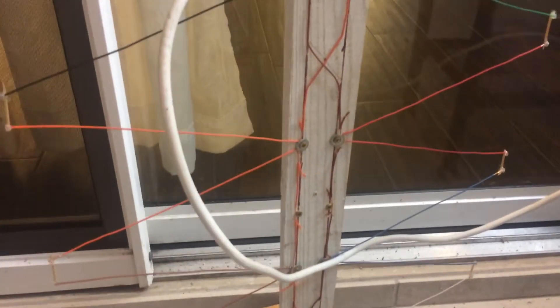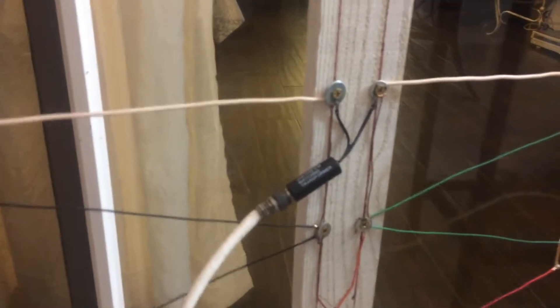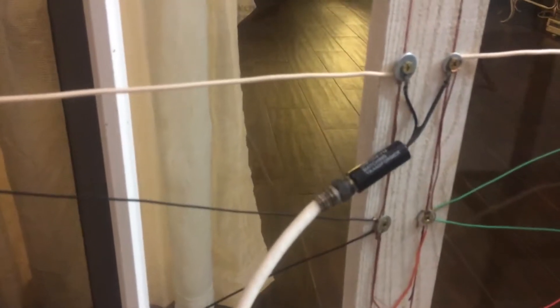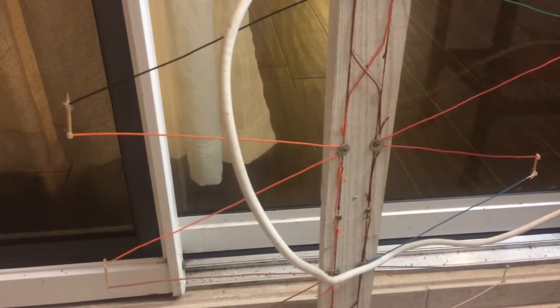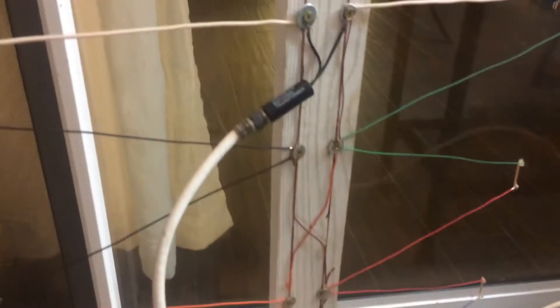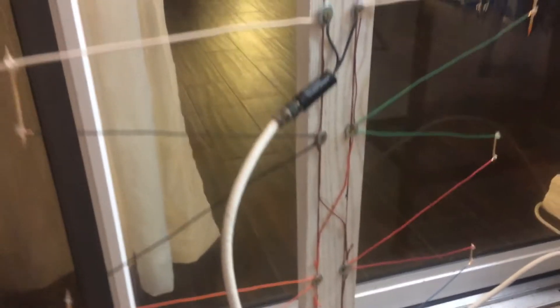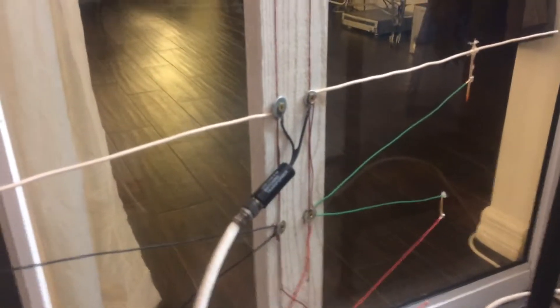After some digging, I found that most people put a VHF antenna on the top. Some people were using two transformers — one on top and one in the typical middle connection — and then joining them with a VHF/UHF separator. But after some testing I realized I didn't need that. I only have one line coming out now, from the top VHF antenna with just one transformer, and that's my feed line going to the TV.